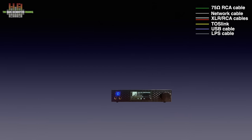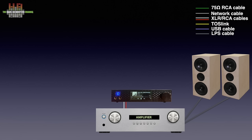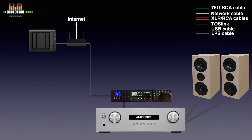The analog outputs of the DAC need to be connected to matching inputs on the amplifier over either RCA or XLR cables. The amp obviously needs to be connected to a pair of loudspeakers. The ethernet connector on the Brooklyn needs to be connected to your router over a network cable unless you use WiFi. A cable connection is more reliable, especially when using the Brooklyn as a server with more Roon endpoints. Over the router, the Brooklyn can connect to the Roon mothership, internet radio, and streaming services. If you have a computer or NAS holding your music files, that music can be played over the network too.